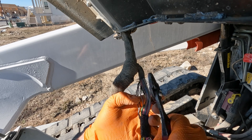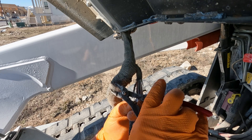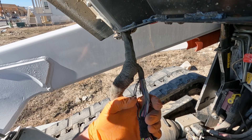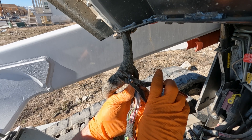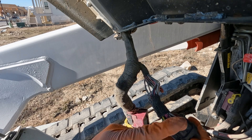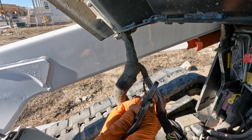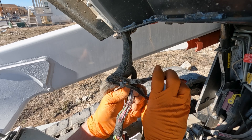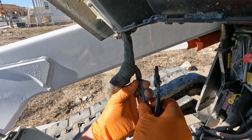Sometimes what we have to do is, if it's rubbed through and broken so bad, we would have to add an extra piece of wire and make it longer. We've done it many times with soldering a new wire in there and taping it up. A lot of people don't necessarily agree with that because they say that soldering gives the wire a weak point because of the vibration — the wire can break over time. But if I was soldering in a connector or something like that, yeah, I would absolutely agree. But for many, many years, if it's inside a harness and we tape it up solid with all the other wires, I can't ever see that actually vibrating and breaking if we use the solder method. But today we're not going to use the solder method — we're actually going to put a crimp in here because I have enough wire.